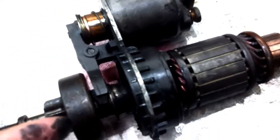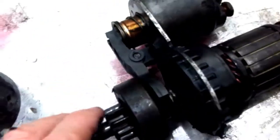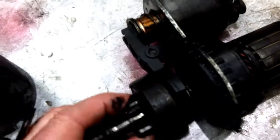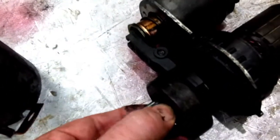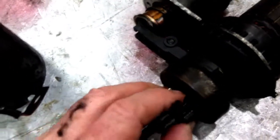There's oil and grease everywhere — a gooey paste. If you look here, the one-way clutch is in good condition. She is free to turn that way and locks that way. So the clutch is in good condition.